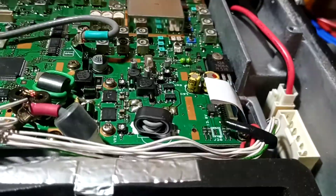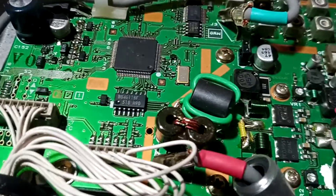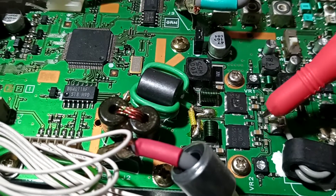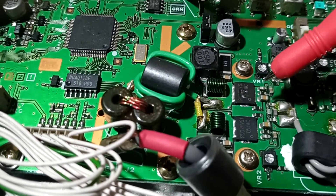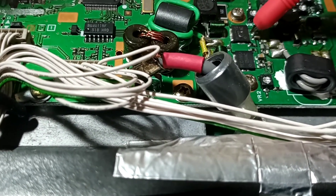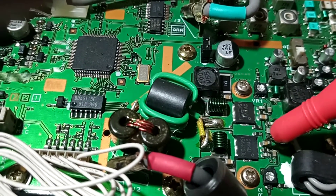I've got the black lead grounded to chassis and I'll take the red probe. With the meter on diode, you'll see three components there — capacitors and an inductor. If we look at the service manual diagram, these connect to the center pin which is the output, each side. Taking measurements from the bottom exciter, I'm getting 0.343, and again 0.343. All three points are connected to the same node, so we just need to confirm a good solder joint.